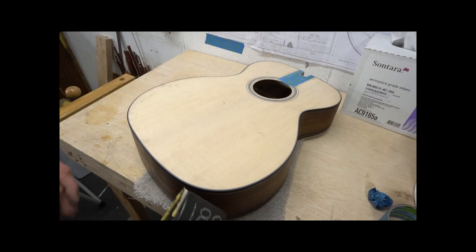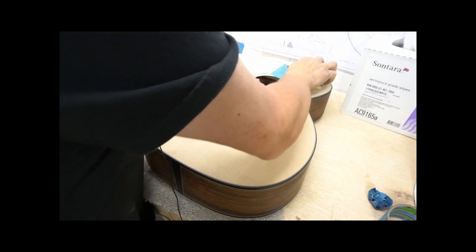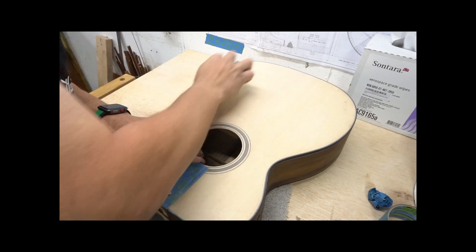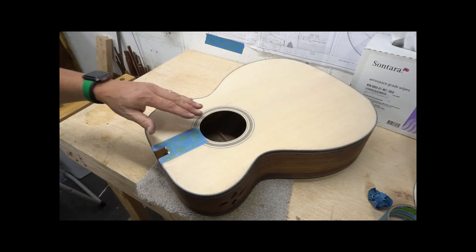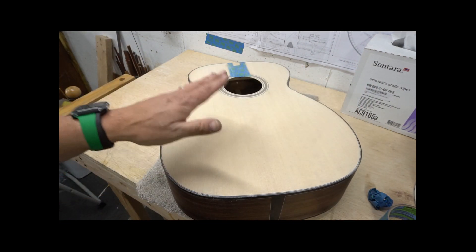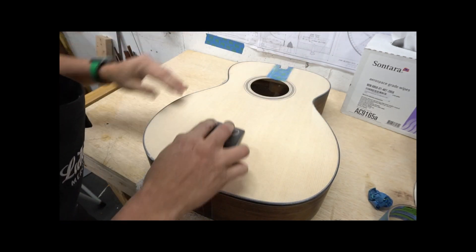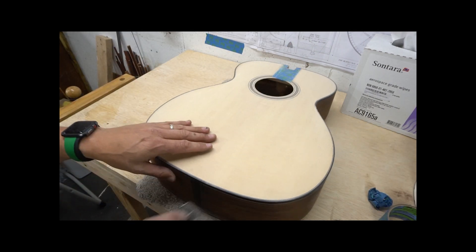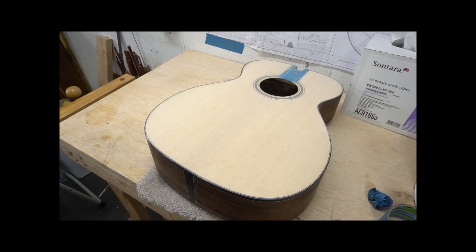The binding is done. Now I'm going to hit this with my block sander. Go with the grain. That is done with 180. I'm going to go through the same process with 220, 320, and all the way up to 400. But you don't need to watch me do that — just make sure that you sand with the grain on all the grits and you'll be fine.